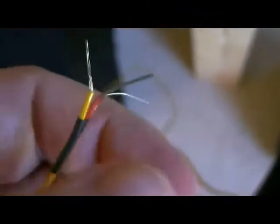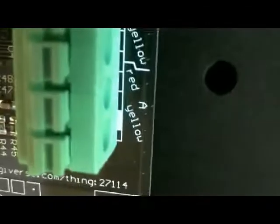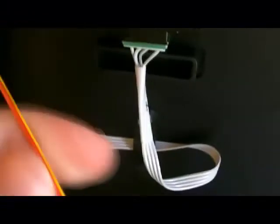As you can see, the new assembly has two colors: red and yellow. Looking at the connector, you get yellow here and red there — it's a push-pull mechanism. So I'll introduce the red and yellow into the holes, with red on top and yellow on the bottom. Now I get to reinsert this cable and then remount the print head until the end.